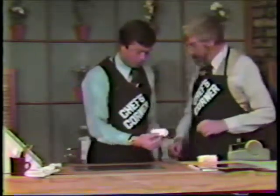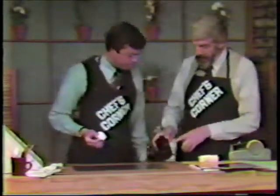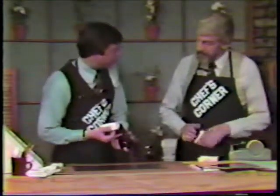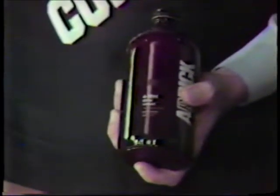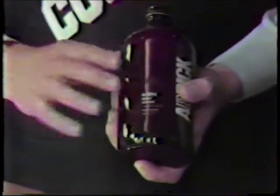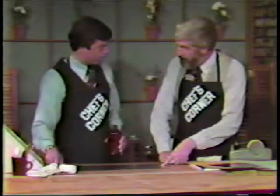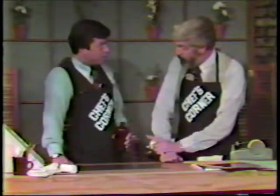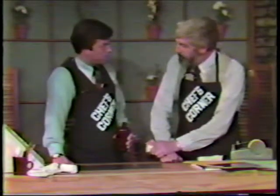One more ingredient now, because the image you can't see at this point in time. Can't see a thing. And you will see it when we add the lacquer. This is offset lacquer. Okay, it's going to put a coating on there, a bright red coating, which is going to make the image visible, and is also going to do something else for you. It's going to give you length of run. This plate could actually be run on an offset duplicator right now, but you would not see much. You will see the image when the ink formulas are applied to it. I see. And it would produce copy, but would not give you the length of run.